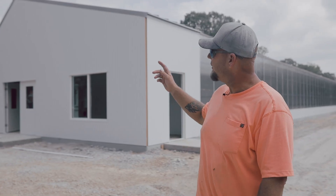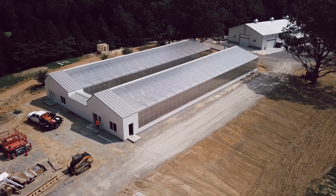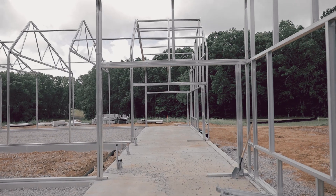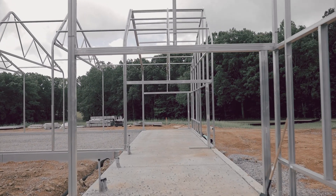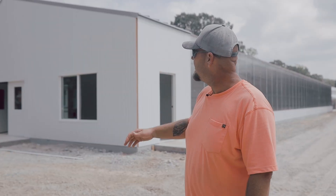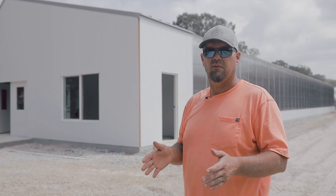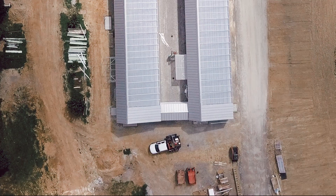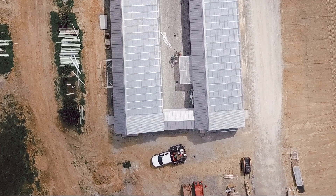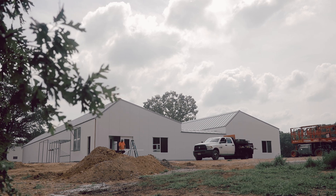What we've got are two 30-foot wide by 157-foot long greenhouses, tied together with what we call a corridor, which is a 10-foot wide by 20-foot long section tied in on both sides. The first 10 feet of each 157-foot length is part of that corridor, giving us a total of 80 feet by 10 feet of separated head house corridor before you get to the greenhouse itself.